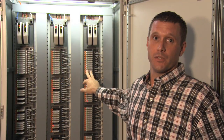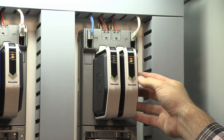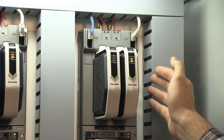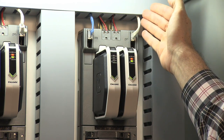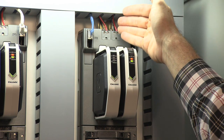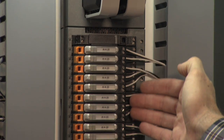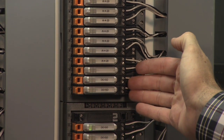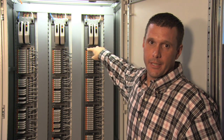So you're not tied to any one single controller. Let's take a look at this solution. At the top of the cabinet, we have the CHARM I/O cards, shown redundant. We also have the CHARM I/O card carrier, which is fully redundant — both communications, either copper CAT5 or fiber, and fully redundant power, 24 volts, which supplies all the cards, CHARMs, and field devices. If you need to inject other power, you can do that here in these external nodes.